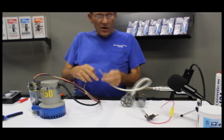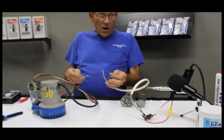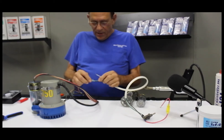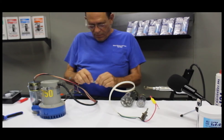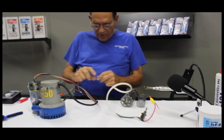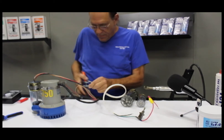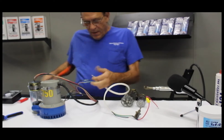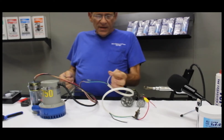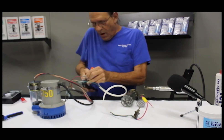The one that's hooked to a three-way splice would go to my brown wire. So look at the one that has the brown of the bilge pump and the one float switch wire — if it's the green wire or white wire, whatever it is, it connects to my brown manual wire. In most cases I like to make the white wire the hot for automatic, and you just put that into the red wire.